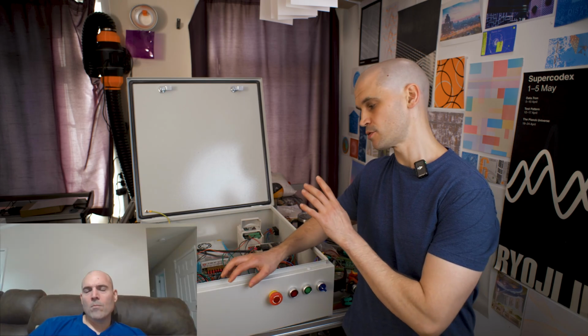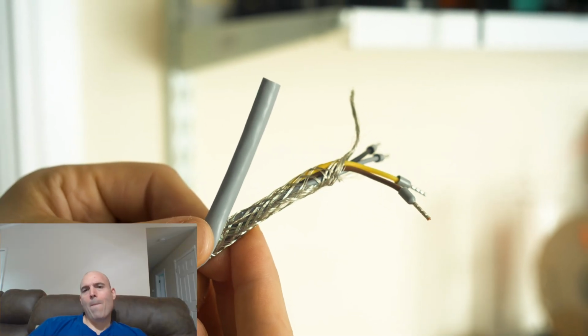The next principle is to use shielded cables, and preferably double shielded cables, for all of your signal connections. Boy, Paul, I have to say I am very impressed. You as a beginner understanding that best practice is using double shielded cable to mitigate EMI, once again protecting those precious signals. That's amazing. But it is really interesting to point out that you contradicted yourself by actually talking about spacing components to mitigate EMI.